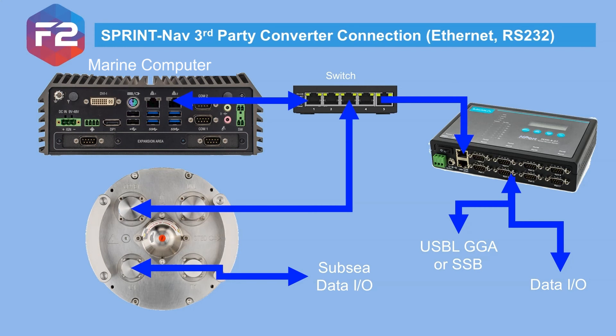Finally, inputs and outputs can be configured to use third-party serial or ethernet converters. Although these are not generally tested with the system in the same way the LCH and NSH are, they are less prone to latency than using the PC COM port and can provide good tracking results. To install these, follow the manufacturer's instructions — the converter must be capable of a lossless 115200 baud rate or higher.